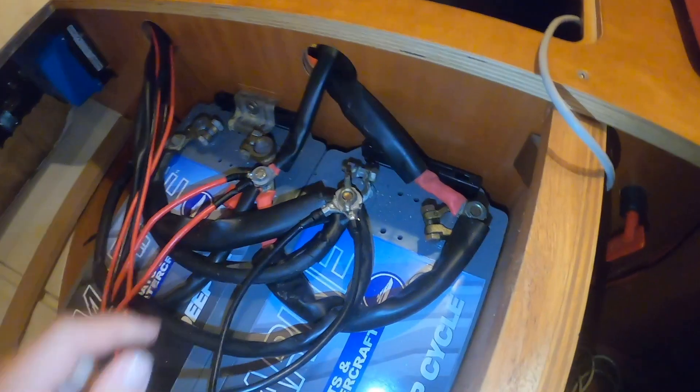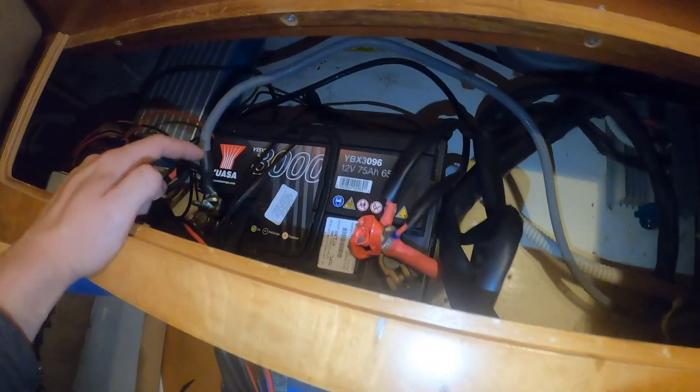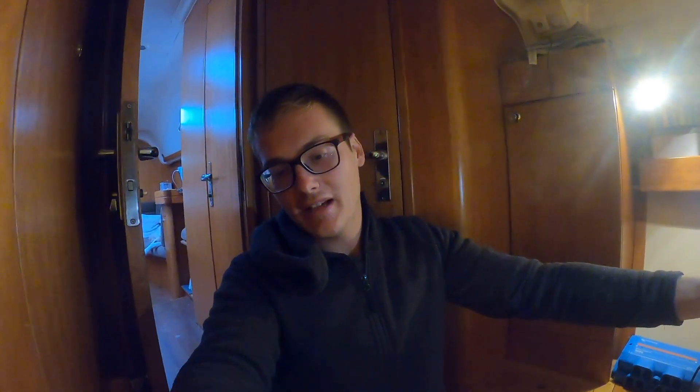Before we go any further, I've had this massive question for probably a year. All the cables come off the batteries like normal — this cable here is our main positive for the house systems, lights, fridges, everything. But there's no negative cable here. The negative cable comes off the starter battery, which is so bizarre. It's taken me months to figure out why, and yesterday I found it. We've been using our starter batteries and house batteries as our house load this entire time, which isn't great for the degradation of the starter battery. Whenever you buy a second-hand boat that other people have wired, there are things on here that should not have been done.